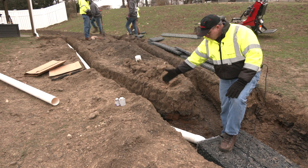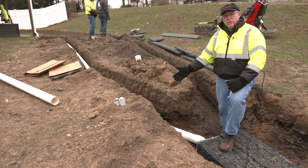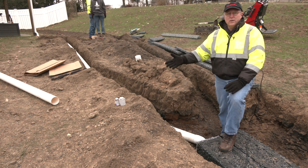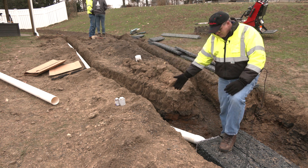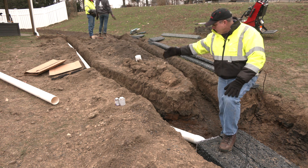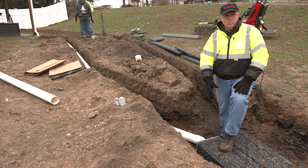What we're looking at here is some 4-inch storm drain pipe. This piping is coming down from the roof, the gutters, and the downspouts. In years past, people would just take their downspout lines, run them into a gravel pit, run them onto the street, or even run them into the storm sewer — which you can't do anymore. So now this piping is coming down through the yard, and we're going to be running these into a stormwater retention pond. We like the piping to be run 20 feet away from the house before you get into the stormwater box itself.